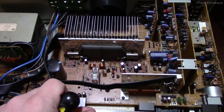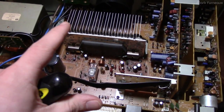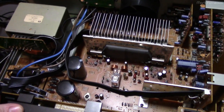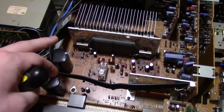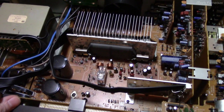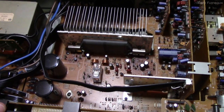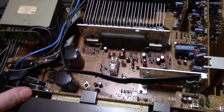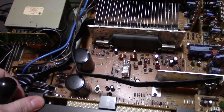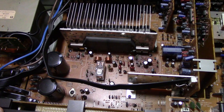Previously I mentioned this amp has two design flaws — I want to go over those now, because the rest of this video hinges on understanding them. The first has to do with the power supplies. Being audio equipment, it's got a standard linear 60 Hz power transformer that's center-tapped, coming in through a rectifier to give positive and negative rails — about ±50 volts, unregulated. You'd assume the transformer would have additional secondary windings to generate lower voltage rails using linear regulators to clean them up, and that's exactly the way I would have expected it to work.